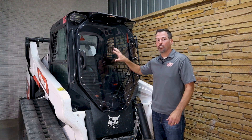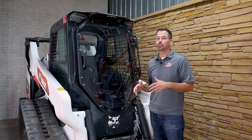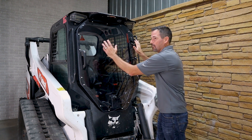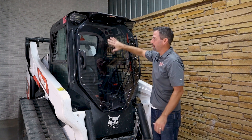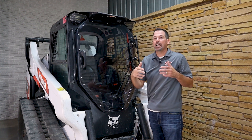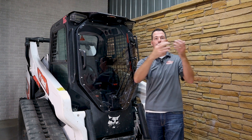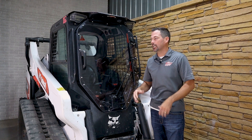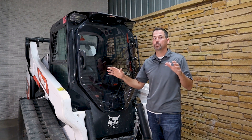For the polycarbonate, our tried-and-true half-inch, dual-sided, scratch-resistant polycarbonate — you'll see that it's not convex. It is a flat plane. What this is going to do is cut down on glare. When you have a convex shape, that light focuses to the center, and that's where you get glare. So this is going to help disperse that light.